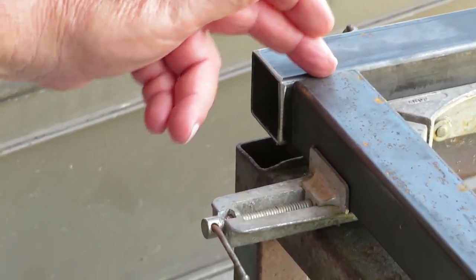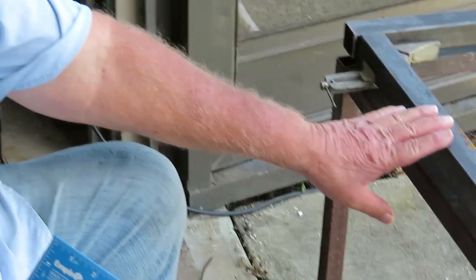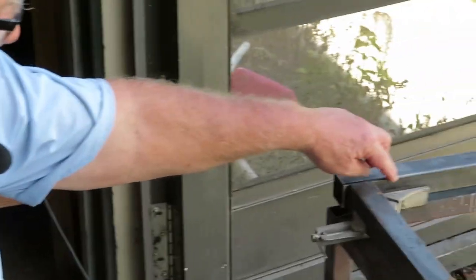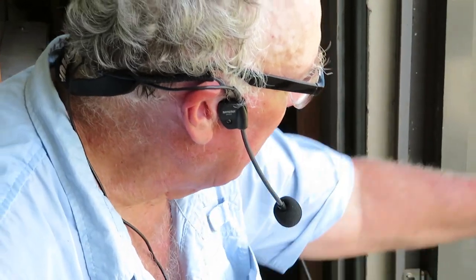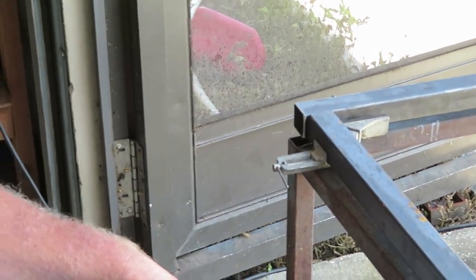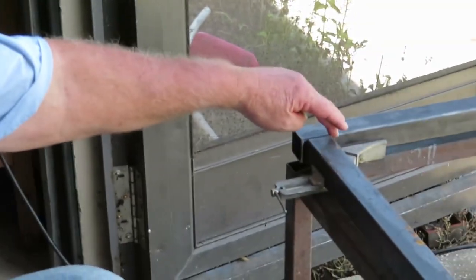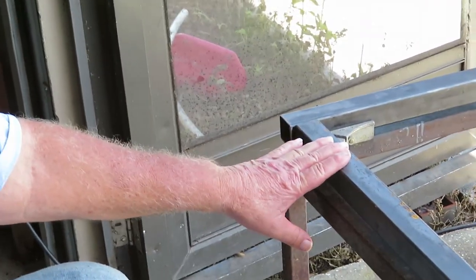The top side joint I will not be welding. The reason why: when I put this beam onto the trailer, a 2x2 angle will go in that corner. If I weld it, it's going to push that angle out - and I'll be welding the angle at the top and the bottom where I'm going to put the expanded metal wire for the floor. So it will all be one piece at that time. I've got six of these to build, so I'm going to start welding right now.